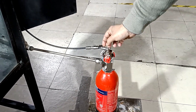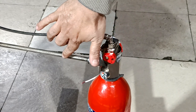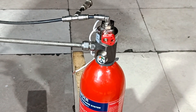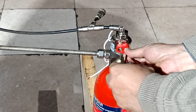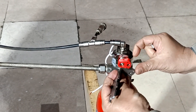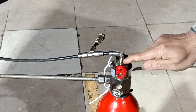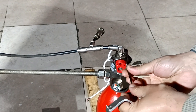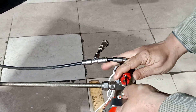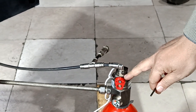Our cylinder has been fixed with the HST line. The HST has been pressurized to 15 bar using the NRV. The output has been connected to our stainless steel supply line of 10 mm. Now to open the integrated ball valve, we remove the safety screw from the integrated ball valve lever and then we use a multi-tool to open the valve. As the valve gets opened, the system is now commissioned and ready for use. This is the normal working state of the valve and the integrated ball valve position. As the safety screw goes in, the lever cannot be tampered.